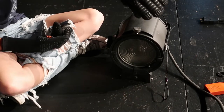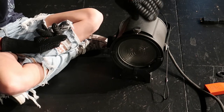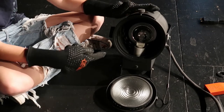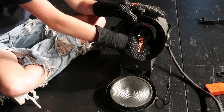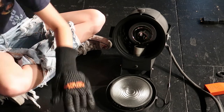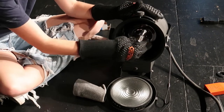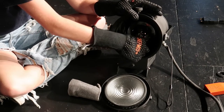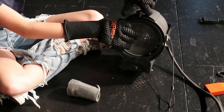This is how we change a bulb on a Fresnel. First things first, take the light off the rack and set it on the ground. Put the little circle knob up, then loosen it until you can bring out the frame — it falls out. Then you can see the bulb on the inside. Push down on the bulb and twist counterclockwise to bring it up — sometimes it takes a little finagling. Take out the new bulb, put it in with the side wings, push down and spin to the right until it can't come out. Close the little glass piece and tighten the knob on top all the way.